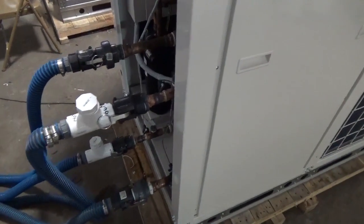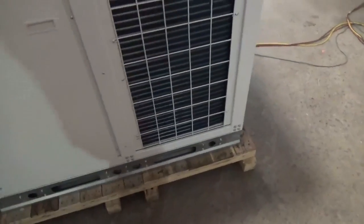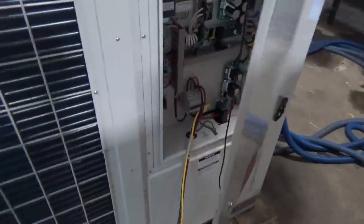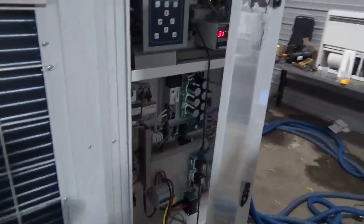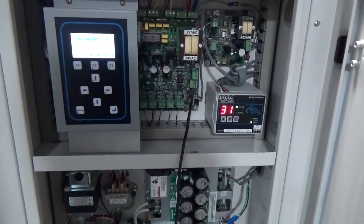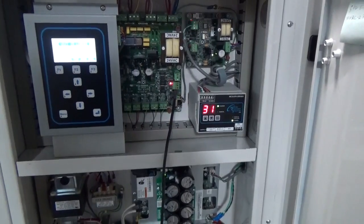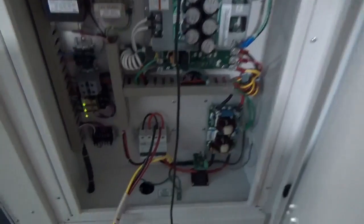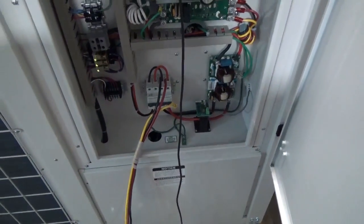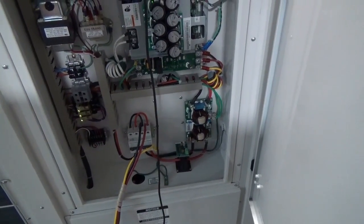You usually see chillers on industrial buildings like hospitals, schools, and hotels, but this is a smaller unit able to run in a residence. What I'm so excited about is this unit has a Copeland scroll compressor. The Copeland variable speed scroll is controlled by the Magnum MCS control system, and that's what I'm excited about — because it allows us to run this unit off of solar and off an inverter.